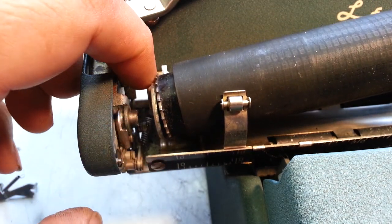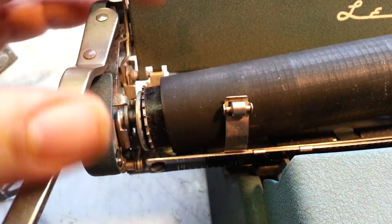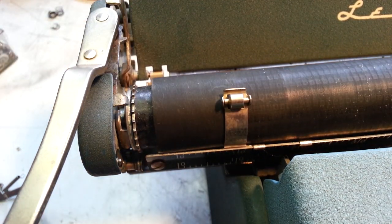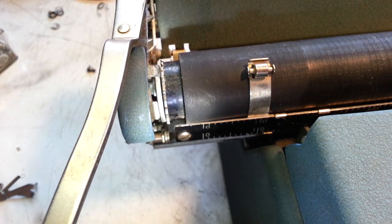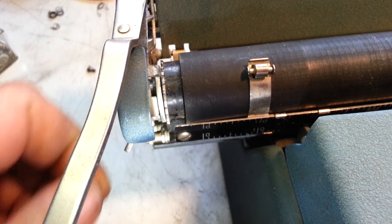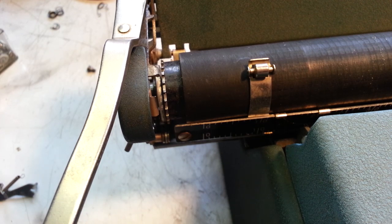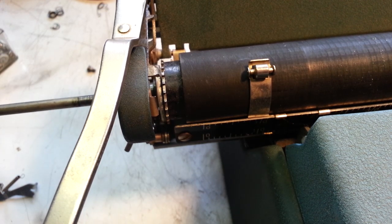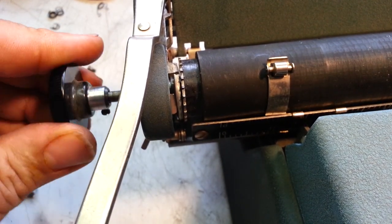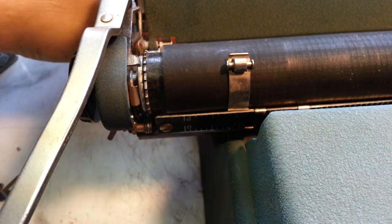That's a little tricky, to get the washer and stuff back in here, but I'm going to move the detent out of place, and then it goes back in. Okay, and if you look, now that's right against that 1-2-3 adjustment right here. So I'm like, okay, that looks pretty good. Pretty good start. So let's put the shaft back in here, get the roller secured at least. Alright, got it all the way through. Go ahead and tighten this up on the side again.